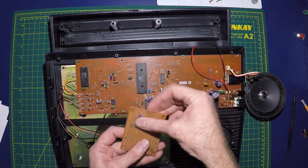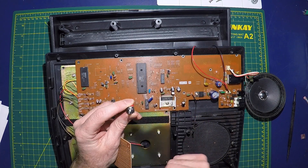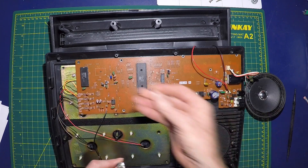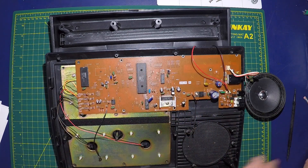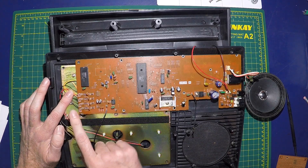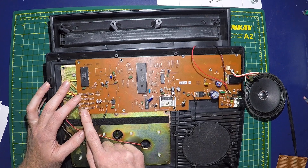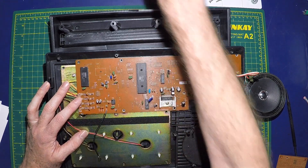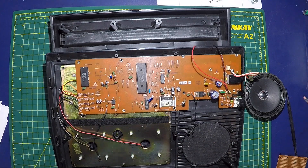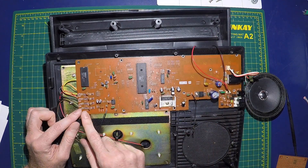I'll be mounting that to this board. So with the toggle switch I can flip on to have the stock timing, and then switch it to the pot that I wire to this board. I also will be adding a gate input to each of the four pads. I've done some testing and found that the gate input actually triggers on the release, so I'm going to have to be wiring in a 4069 hex inverter so that will flip the signal.